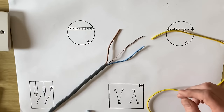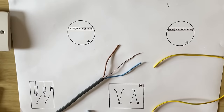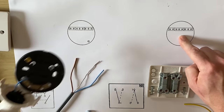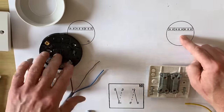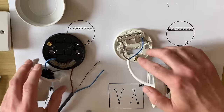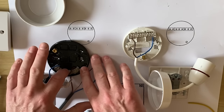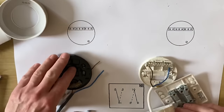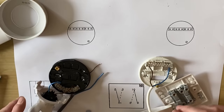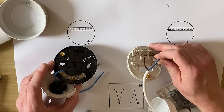It's going to follow the same process. These up here are wiring diagram drawings, and these three positions represent the back of a two-gang switch. These look like either a batten lamp holder or a ceiling rose and pendant. We've looked at these previously — we've got a block of three, block of three, block of two — and likewise on the other fitting. We're going to be using the connections we're really comfortable with from the three-plate looping method we've seen previously.